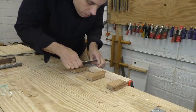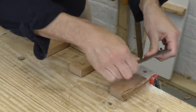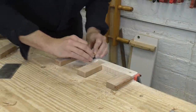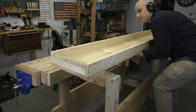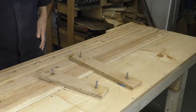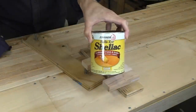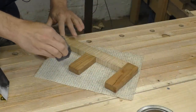Now it's just finishing. To smooth it out, I'm going with a card scraper. I've got wood going in a bunch of different directions, and planing this would be risky. Scrapers are slower, but they don't tear out and they don't really care about grain direction. Then I sanded the piece with several grits, going all the way up to 400. I don't usually sand my projects, but for this one it was the best solution. I can't do the finishing where I just did all that dusty sanding, so I'm going to go over to my new workbench. We made the rear tool well convertible, so you can just flip it over and get a big, flat work surface. My finish is shellac out of the can, applied with a cloth rag. I do two coats with a light sanding in between, and I rub out the final finish with paste wax on steel wool.